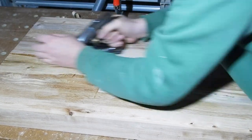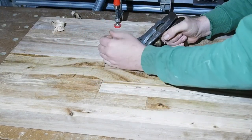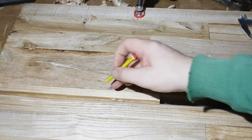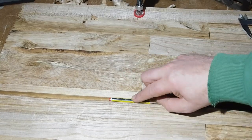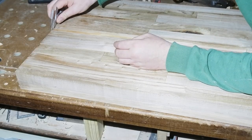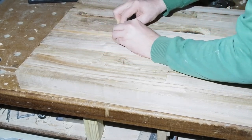You might notice some end grain joins have some gaps — that doesn't really bother me in the slightest. It's the along-the-grain joins that matter, and they're super tight. One gap that is playing on me is this one though — the remnants of a waney edge on the underside of the top, big enough that you can drop a pencil in it. This is a bench top intended to withstand a bit of a beating, so I decided to route this out and fillet it. I set the caliper to the widest point on the waney edge, then run it along the straight to score a line to size the fillet.